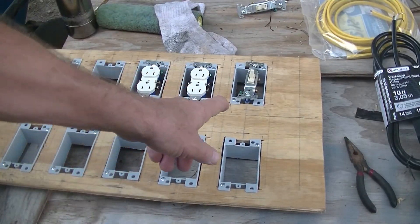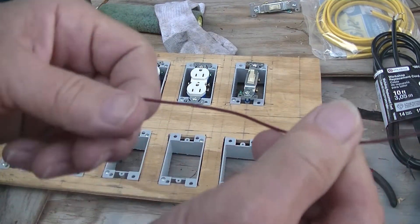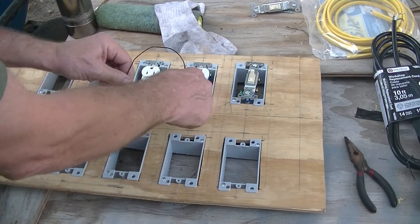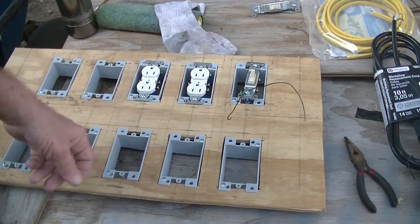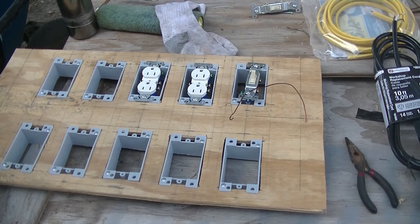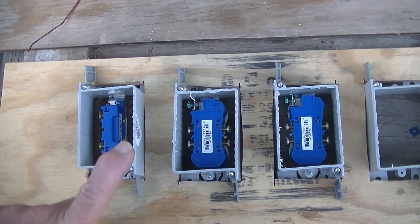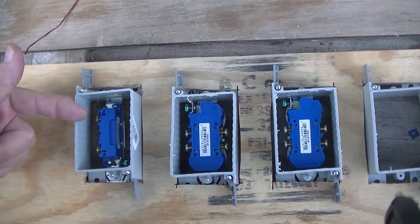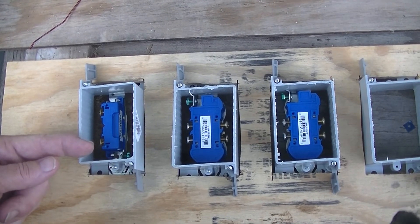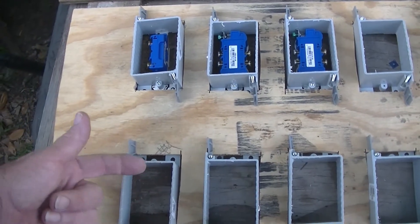For now I'm going to put this in temporarily. I've got some easy-to-bend wire, some old magnet wire from a transformer, and I'm going to do my jumpers and see how long a piece of wire I need. So here's the board reversed, here's the switch. To keep things simple: all the inputs go on the top and all the outputs go on the bottom. So that power cord I just showed you goes in here and in here.